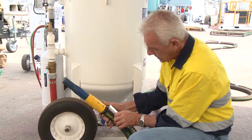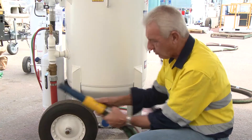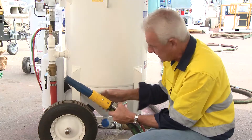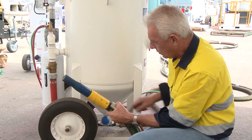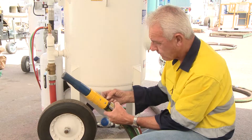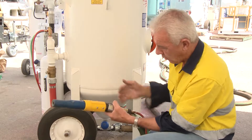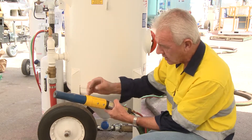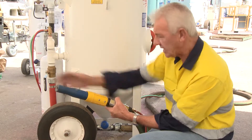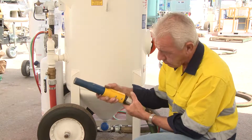When you depress the safety pin and open the dead man again, you'll find that the hose starts to push towards you and then push away from you — it has an inertia type reaction. When it pushes away, it also comes back at the same speed. That means you've filled the blast hose with abrasive to such an extent that it's stopping the airflow. The air has to eventually clear that grit, and all of that grit will accumulate towards the end of the nozzle. Because it's a Venturi nozzle — large to small — as the grit is trying to exit and the air is pushing it out, you'll have an inertia reaction with the nozzle itself pushing back on you.